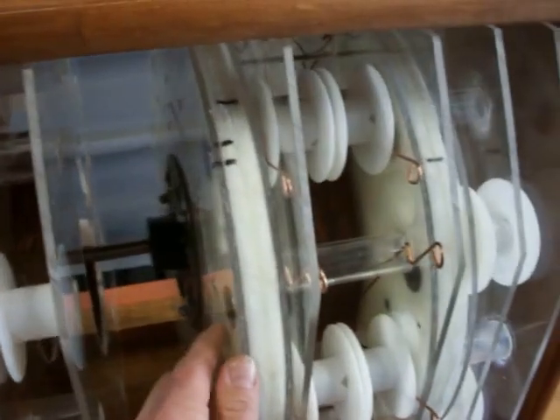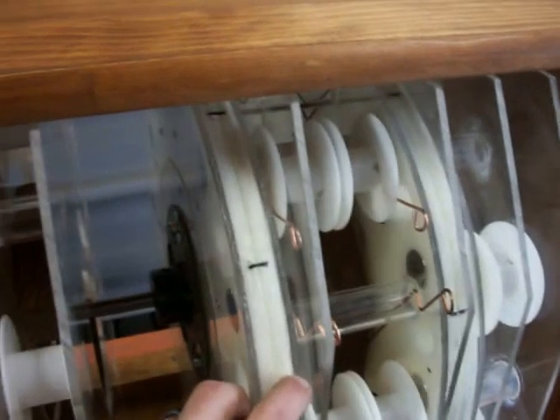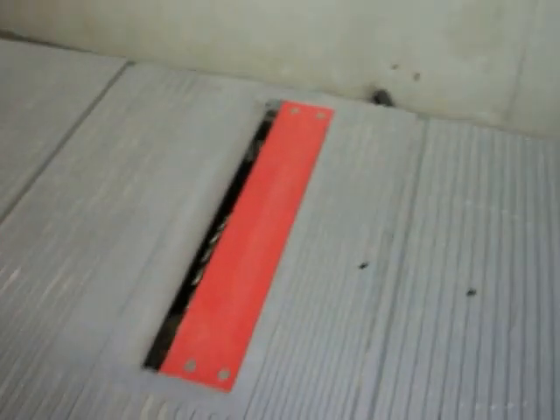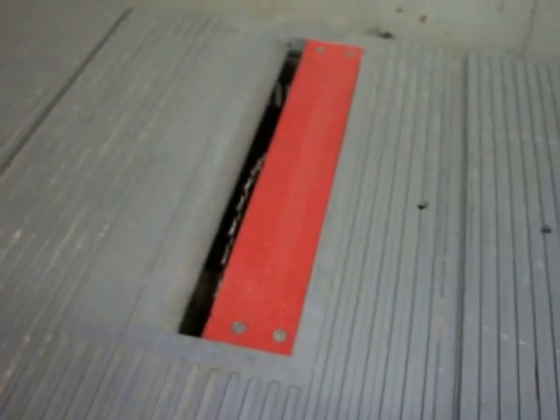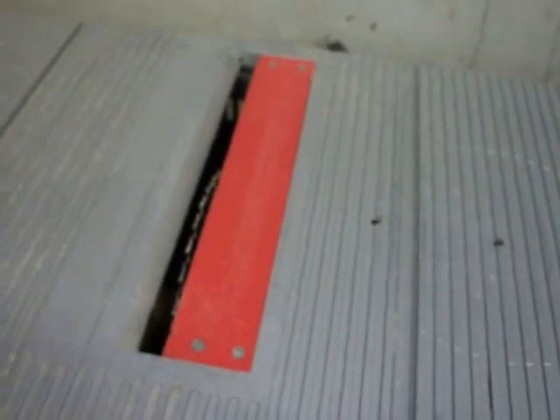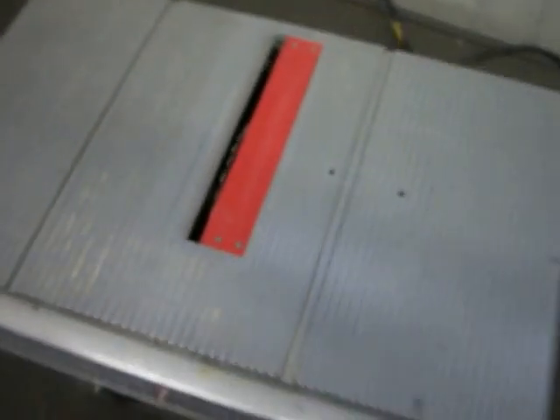The wheel is basically made out of cutting boards from Walmart — two cutting boards on each one, the big ones, because they're 15 inches. If you're wondering how to cut anything round whether it be wood or plastic and you have a table saw, just drill a hole with the blade all the way down, run a peg through the hole, and slowly crank the blade up spinning your piece of wood or whatever. There's a guy on YouTube that has a demonstration of that being done.